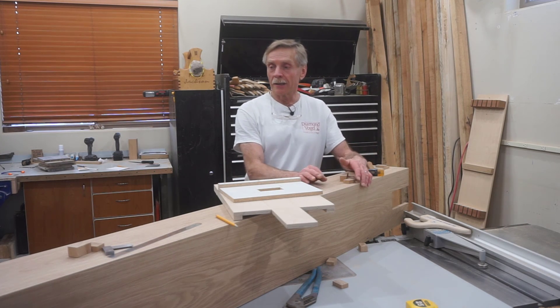The key to making this type of false joinery quickly and accurately without putting unrealistic cost into the project is with jigs and templates. The main one I have for this project is this one right here. The center piece is the exact width of the tenon, which is equal to the exact width of the mortise. I made the fixture by sliding this piece forward and gluing it together so that there's a seven-inch mortise that matches the seven-inch tenon in equal width. I added edge guides or fences on each side so it's centered on the beam.